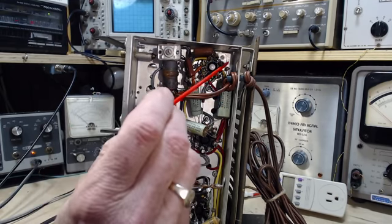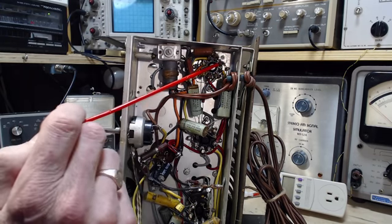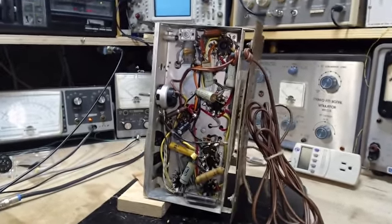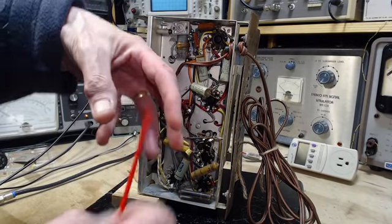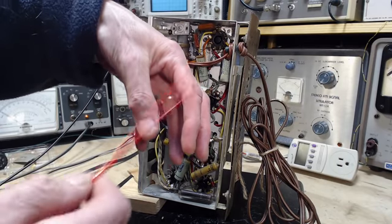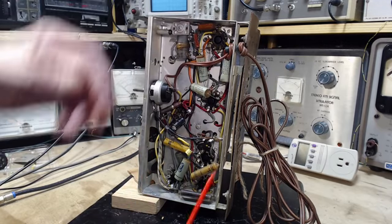Now you have to look close, but there's another wire coming up from down there. It's coming right up to this terminal on the tube. This is terminal 1. On tubes with metal shells, like that one, pin 1 is almost always just a connection to that metal shell. And you can think of the metal shell as just more chassis. In fact, in this case, the metal shell is floating right on top of all the tube elements. So if you don't do something about this metal shell, in terms of draining out any signals that might be in it, this thing will act like an antenna for all the stuff inside the tube. They're going to pick up a lot of stuff.